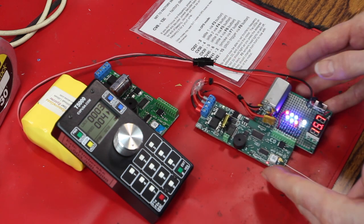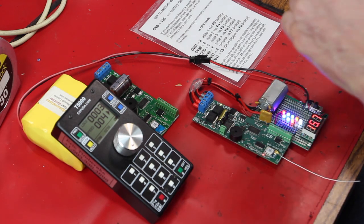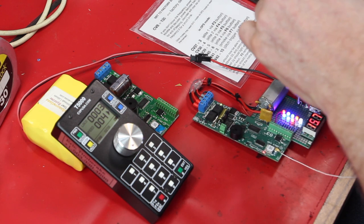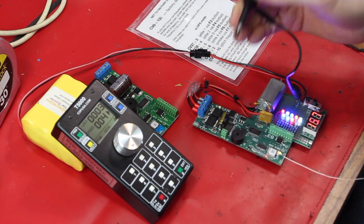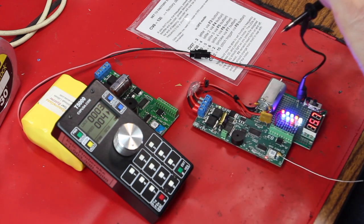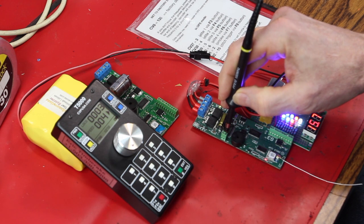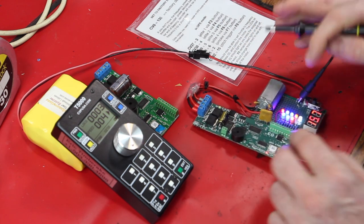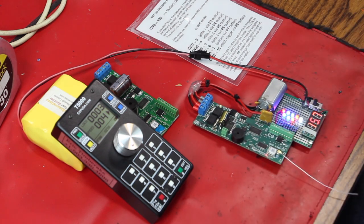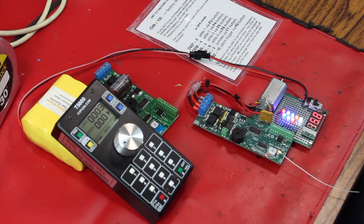We could also, it's kind of outside of the scope of this question, I've got a nice ground connection on this jig, so I can hook up my oscilloscope quickly and easily. Oscilloscope, ground, and I can use it to see stuff that you can't see in the frame, which is I can look at the DCC output and tell that we're getting DCC commands set up. And I have done that. These boards are ready. They are done.